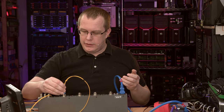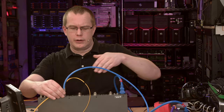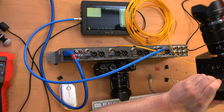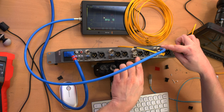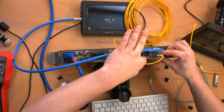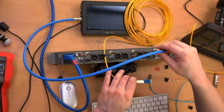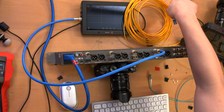For completeness, I'm going to hook this up using single-mode fiber with the Blackmagic Design SFPs — one in the camera, one in the studio converter. With the yellow single-mode fiber attached and swapped-out SFPs, it's working just fine. One thing I don't like about this design is that they put the SDI out right above the fiber optic connector, making it really hard to get your finger in to release the fiber optic connector without first unscrewing the SDI connector — especially in the back of a rack.